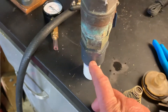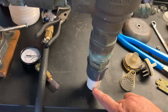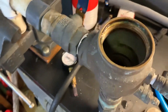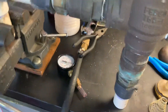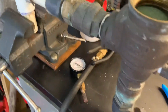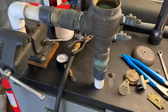As far as the install, it's real easy. I had to use Schedule 80 pipe here just to get a little more beef on the main connections — it's one-inch pipe, which is typical for residential sprinklers. Cutting it out and using some couplers with Schedule 40 one-inch pipe was very easy. I assembled the whole thing except for the couplers facing down, and the last connections I made were priming with purple primer and then cement on both connections, then pushing the entire housing down onto the cut-off stubs.